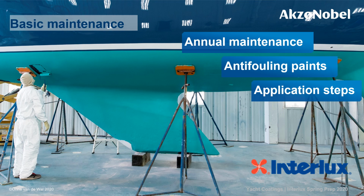One of the most popular questions we get is, do I need to repaint the bottom of my boat every year? And the answer is, it depends on what type of anti-fouling paint you are using. Is it a multi-seasonal polishing anti-fouling like Micron, or is it more of a seasonal ablative or a hard anti-fouling?